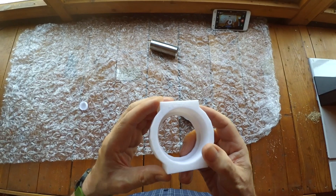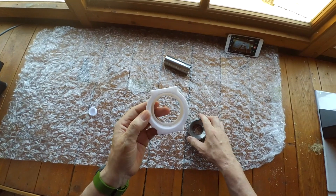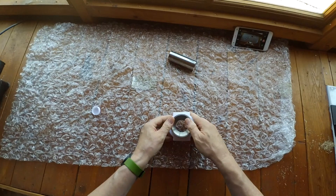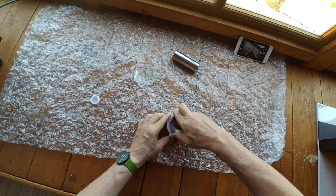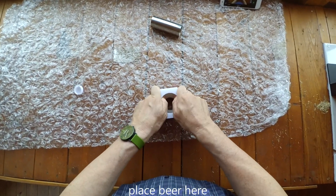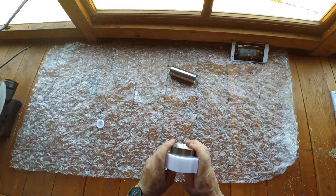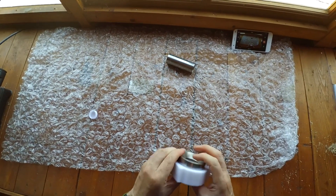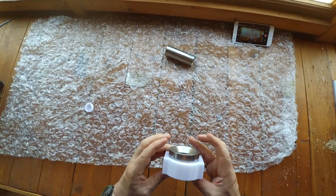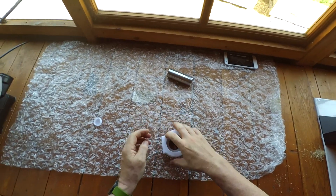Well, this is the physical realisation of the jig. And this is the part which is to be placed inside the jig for drilling. The fit is very carefully engineered to be tight. The problems you're seeing here are because of printing blips around the holes on either side where minor overhangs have occurred. But once this part was placed in and removed, the fit was extremely good after that. It does need to be a tight fit — it can't really move inside the jig or it won't work properly.